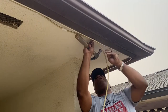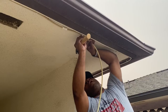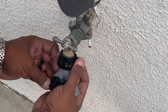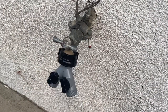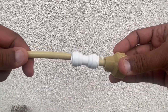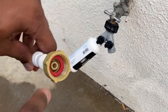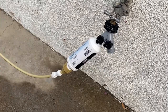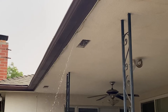Next I continued mounting that extension tube until I arrived at the water source. Once there I connected the two-way shutoff valve to the faucet, inserting a rubber washer for an airtight seal. It was then time to connect the faucet attachment to the hose — I used the 3/8 SharkBite coupler and a rubber washer again. As the directions ask, I flushed it out by running the water through it for two minutes straight, then connected the misting line and turned on the water to flush the full system, removing any impurities from the line.